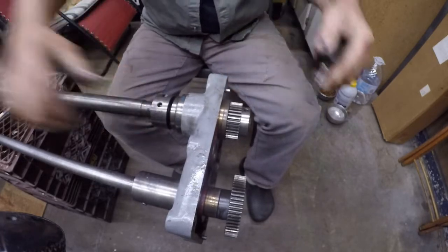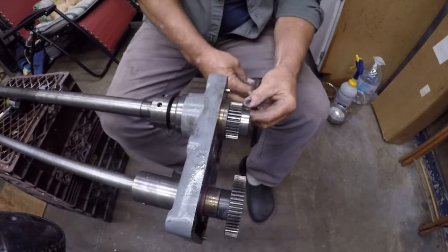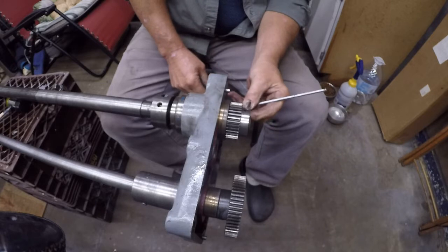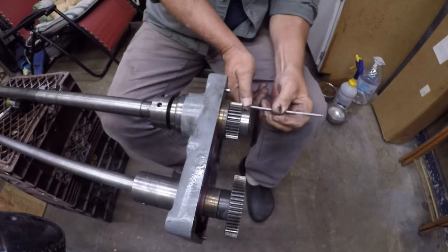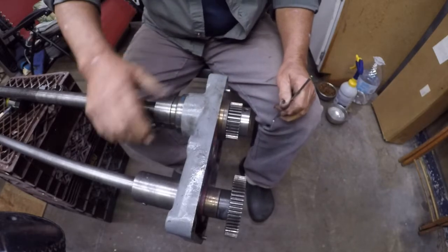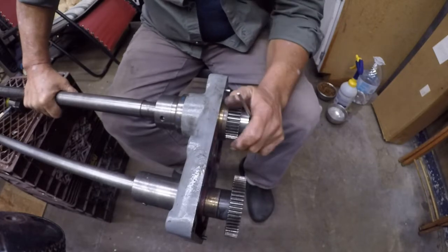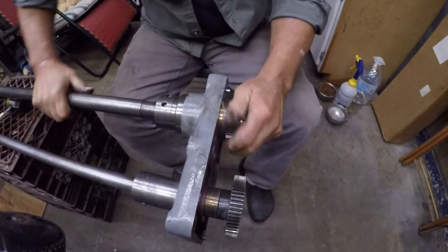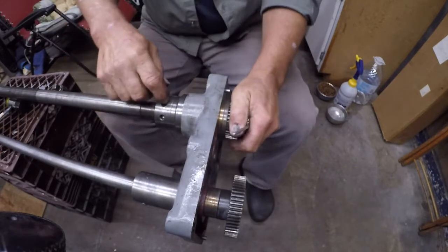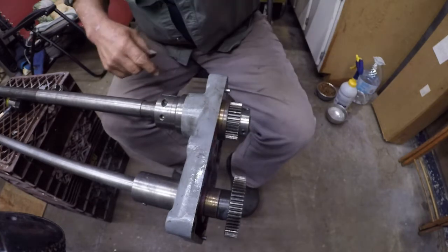there it is. And there is a set screw on this. There's a 5/32. There's a little brass chip down in there to engage with the threads. And then this just gets snugged up here. And it turns. And that can be clamped down too. I might not do nothing to that. If I feel like anything's getting loose, I'll give that screw a turn, give it a tug.